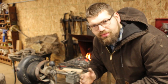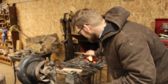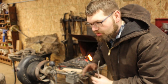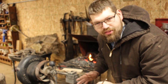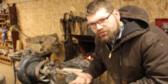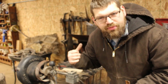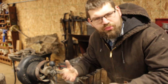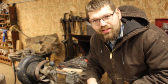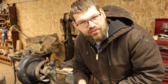But this also leaves me with a question: will this work with other metals? What about this chunk of stainless steel? What I was using before is just low carbon, what we call mild steel — it's 1018 cold rolled, and I normalized it so it had as little stress in it as possible before we started. I also found a piece of copper bar that's about the same size. Will it work with copper? The curiosity in me just has to know, so we're going to try it with stainless and with copper. But right now, let me show you the practical application side of it.